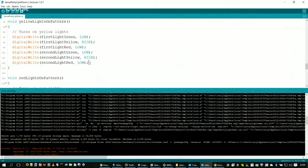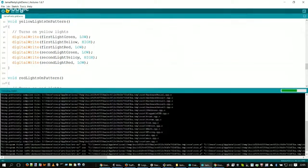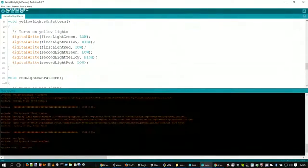If you did something where, let's say, you forget a semicolon, which is bad in C or C++, and I try and upload that now, you're going to see I have a compile error. It tells me what the compile error is and what line it's on, so I can go to that line. In this case, it's highlighting that line for me. So it's a smart little editor as well. And then I can put the semicolon back, and it should recompile. And there it is.